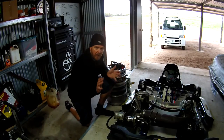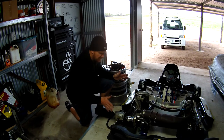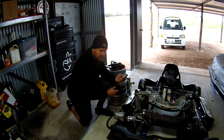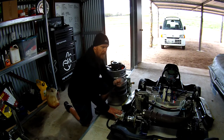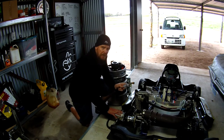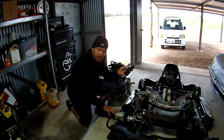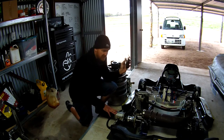Now that we know where our horsepower and torque figures come from, it's clear that we've got a maximum horsepower we can measure with this dyno unit. There's only so much fluid we can flow through this pump and only so much pressure our pressure transducer can pick up. Our pump is rated to 250 bar flowing at 30 millilitres every revolution, but our pressure transducer only goes to 200 bar. We found from early dyno tests that we're right on the top of that scale. Ideally we'd like a 250 bar sensor, but they're really hard to find in a voltage output — if you know where to get some, please let me know.